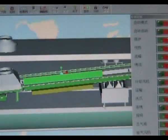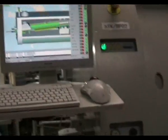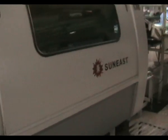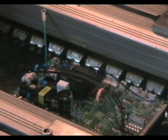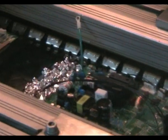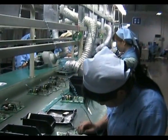This is the control software for the actual machine — it's a lead-free system, and it's a Sun East brand machine. Let's take a look inside where the magic happens. This is the solder bar. This is actually quite dangerous because the solder can splash. You can see the board going over the solder wave here, and that solders all of the through-hole components. The board actually contains a mixture of previously assembled surface mount parts, so you do the surface mount parts first and then put it through the through-hole wave system.